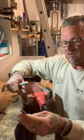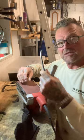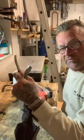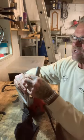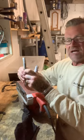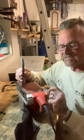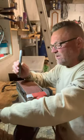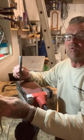Now, as I've told you before — if you've not seen the video — when you joint the brickwork, when you point it up where this is rubbing on the clay bricks, eventually you're going to get grooves in the front of this. And once that gets to a certain depth, those grooves, it's game over — absolute game over. It looks awful.